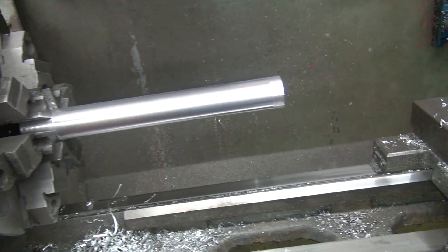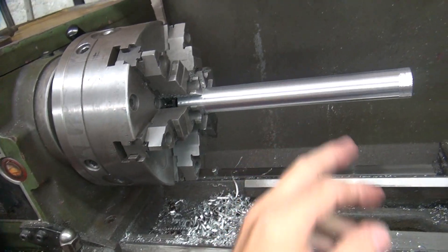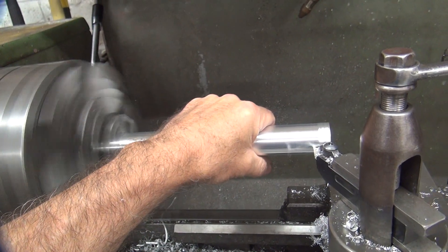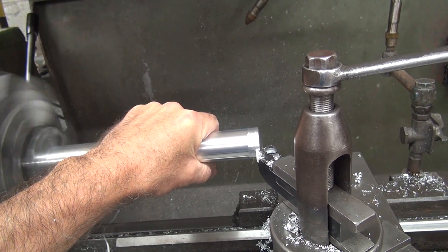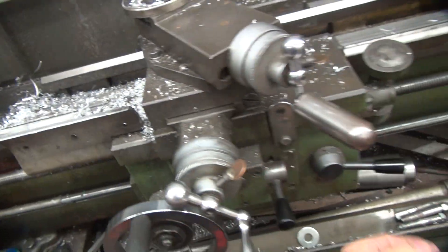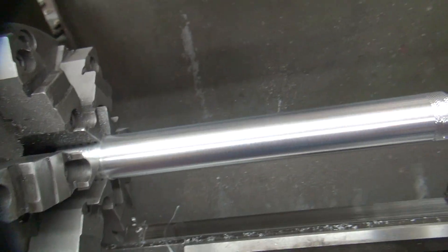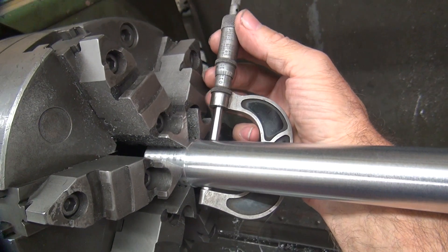That is not what I wanted to see. So I re-centered this all up, but I don't know why that's different — I didn't change anything. I'm going to cut it again and we'll see what it does. We've got about a four to five-mil cut. Once it starts chattering, it's hard to stop. I definitely cut quite a bit more here when I came back to do the cut — got real light through here and it started cutting heavy again out there. Maybe we got a halfway decent result — we'll find out.